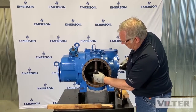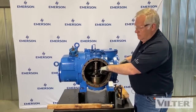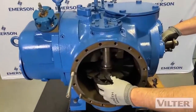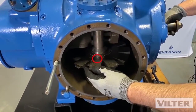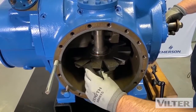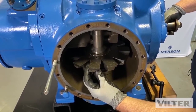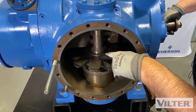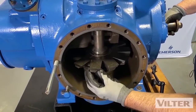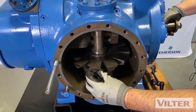So if I turn this around, you can see there's a bushing in here. What does this bushing do? It locks the blade to the bearing, or to the blade support. So if you can see here, I can move this blade on the support. See how that support is moving? That movement right there is that bushing — that pin and bushing. So we have to measure how much wear we have in that bushing for the health of that bushing as well.